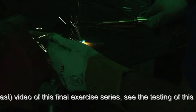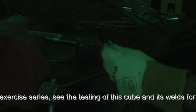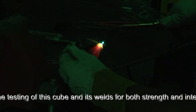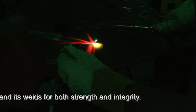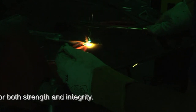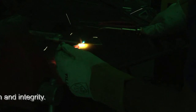We're now to the end of that bead. The fourth bead is a combination of slight overlap that won't require much or any filler material, and I'll introduce the filler when I sense there's a gap or lack of material. I'm going to start with just liquifying this on the corner. I always think of this in terms of being liquid tight when I'm done — if you're trying to avoid gaps or voids, approach it as if you're trying to make it liquid tight. The angle of the torch is critical. And that's the fourth bead.